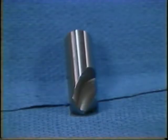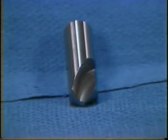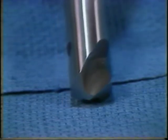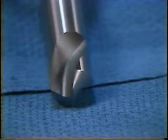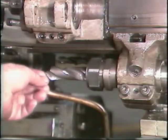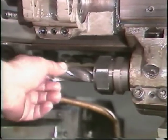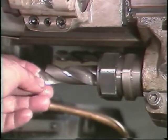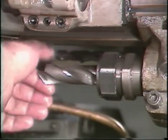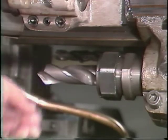This is a spot drill. The only difference between this drill and a twist drill is that the spot drill is used to start a hole to be drilled, and it usually has a sharper angle of cutting edge or drill point to prevent walking or run-out. Drills, like all other cutting tools, get dull. As a good operator, you must continually check all of your drills to see that they are sharp and cutting correctly — if not, you must change them.